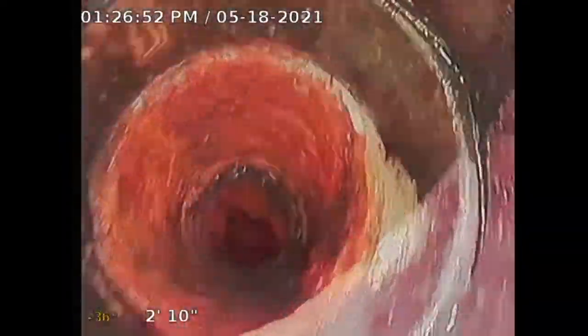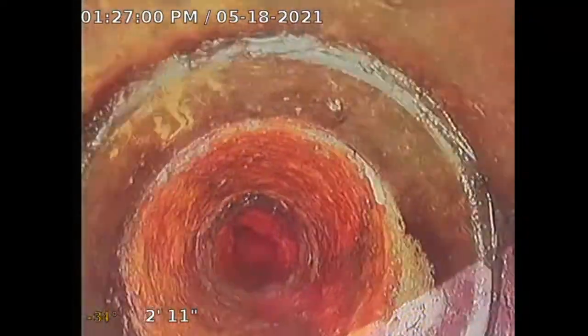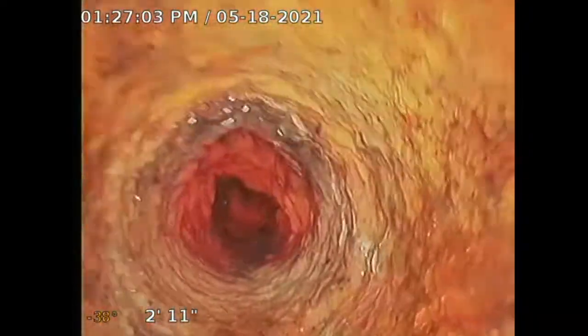The goal here is to get to the main city sewer connection. It might be a little difficult because I'm so far back in the property — it doesn't have a clean-out in the front. This is a two-inch line that does not allow me to put a spacer on my camera, so it's going to be traveling on the floor. I'll give it a go.